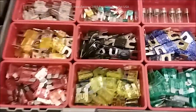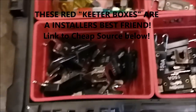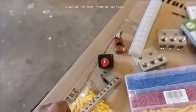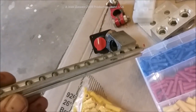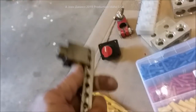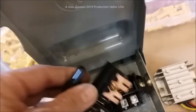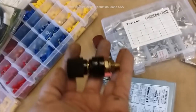I install with lots of fuses: mini ANL, mini glass fuses, big ANL fuses, maxi fuses. Please fuse your system. Don't come home from mowing the yard and find your living room full of smoke. One customer's plastic burned through his garage wall — he couldn't figure out why. It's because clamping force in DC is critically important. Those zinc fittings in that AC breaker have no clamping pressure — they just don't do it. Don't be an idiot; buy the right things.